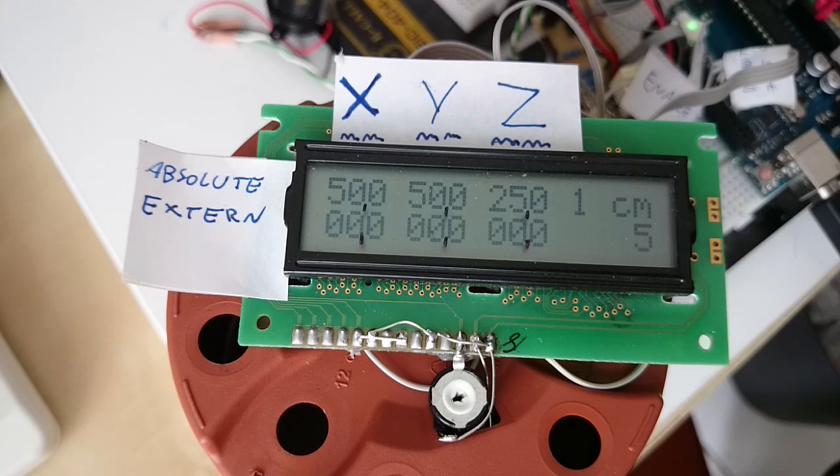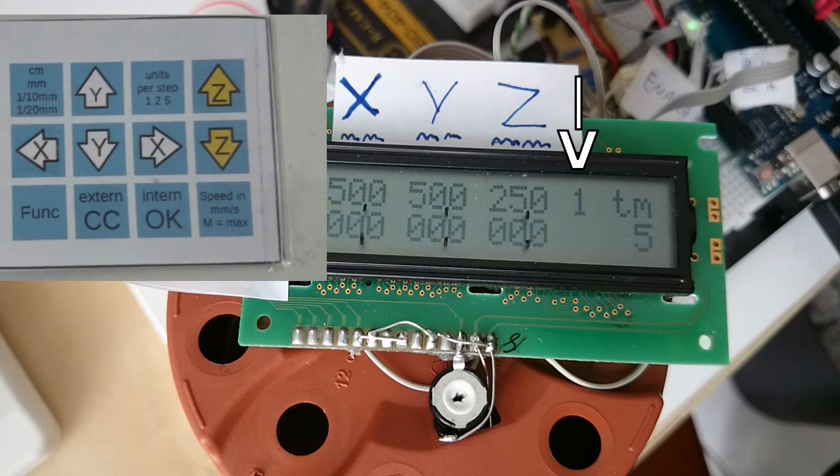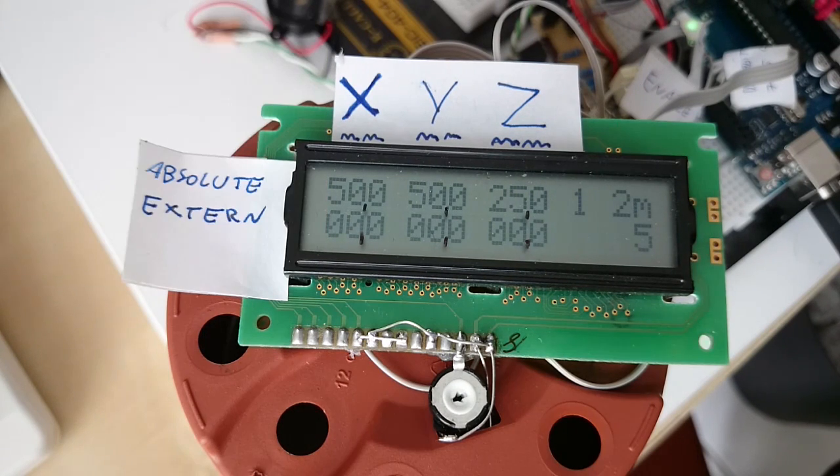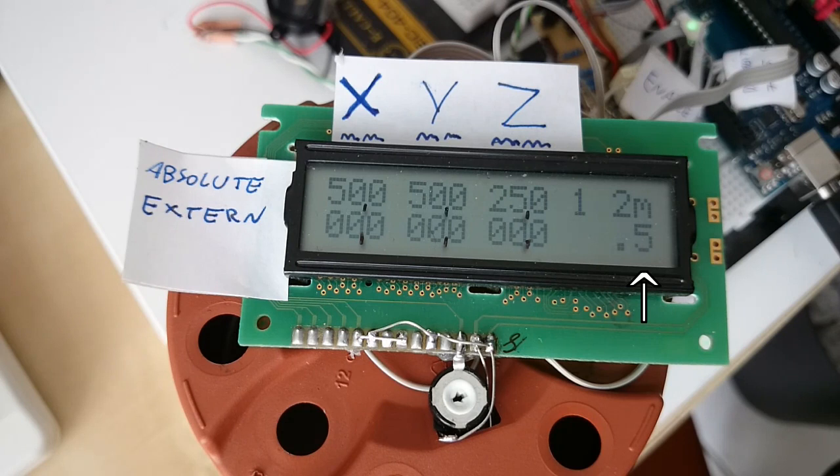for the numbers. The first row displays the absolute machine position, the number of steps for pressing one of the arrow keys, and the distance to travel in one step. The second row displays the X, Y, and Z position for the GRBL Arduino, which is usually starting at 0. Next to that, on the right, the row shows whether one of my border keys is pressed and the moving speed of my machine. Each number has 4-digit space, with no space in between them.